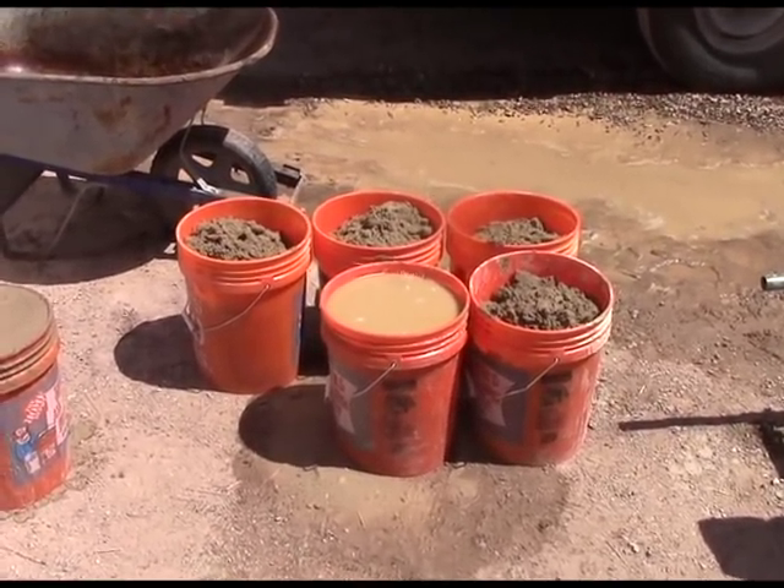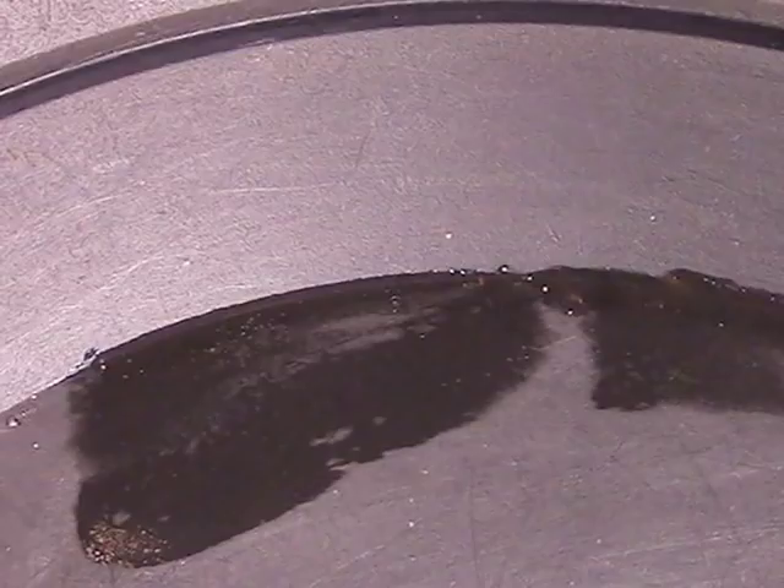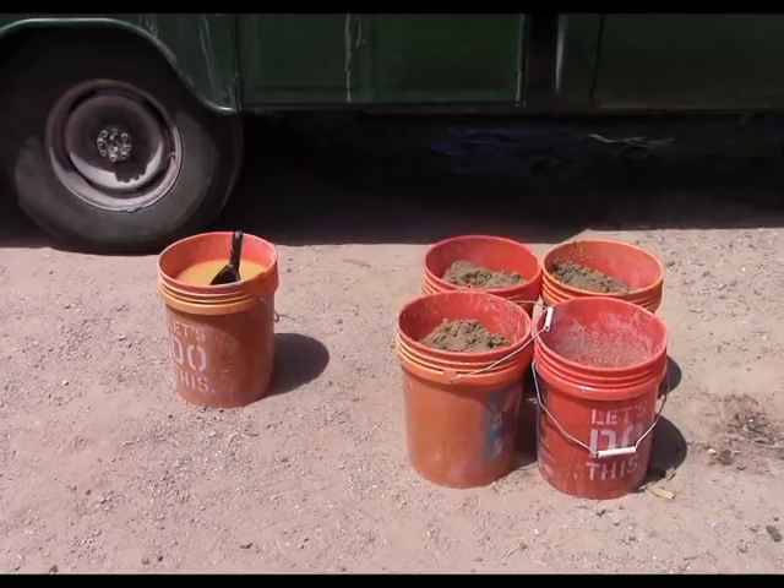Let's do some calculations. I'm guessing I lost about one to two buckets of slimes due to overflow, so I'll assume a cons-to-tails ratio of about six to one. Therefore the concentrates grade of an estimated quarter ounce per ton divided by six equals about .035 head grade — pretty consistent with the average of what was tested in those buckets. Still don't have any assays so I can't tell for sure. I would guess I got at least about 80% recovery, maybe better. This also agrees with yesterday's test on the high grade — here are the tailings test pan and the concentrates test pan from the high grade, and the buckets of cons versus tailings from yesterday. So again, same thing — about 80% recovery.